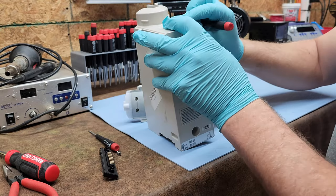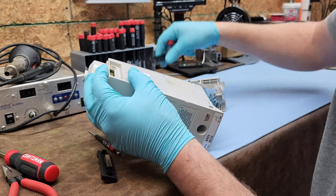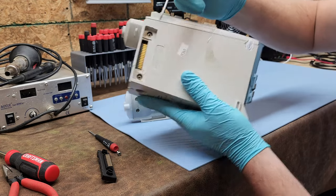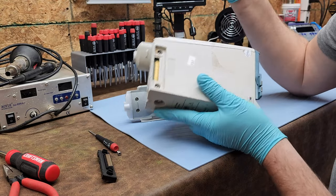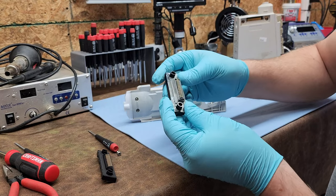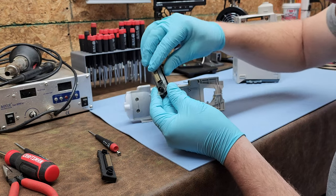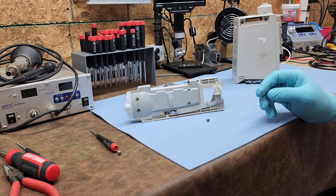The whole reason you see me wearing gloves on this teardown is because this is an infusion pump, and infusion pumps are absolutely disgusting — wear gloves while you're working on them. You can see immediately what was causing the pump port to stay in there: there's schmoo behind it, heme blood, that's what it appears to be. There's blood behind the port. The rubber gasket on this side was damaged in multiple spots, and that damage caused it to leak. You can see where the gasket was not sitting in there correctly — it leaked all around, got inside, and created comm errors and a whole bunch of other problems.